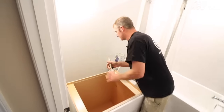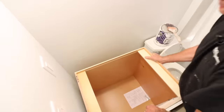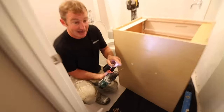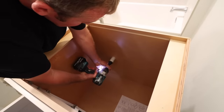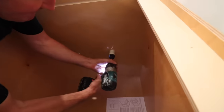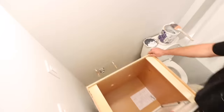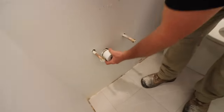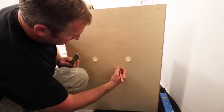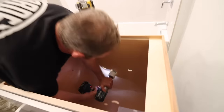This will take all the mystery out of vanity installation. Make sure your vanity is level, then dab the hot and cold water supplies with paint and push your vanity up against that paint — it'll mark the location of the supplies perfectly on the back. Pilot drill through that from the back, then use a core bit with a pilot bit to drill through the front; this will prevent any splintering and give you a nice professional look. Then dry fit the vanity, make sure it fits, and mark the pipe coming out of the wall for the p-trap and do the exact same thing. Pilot hole through the back, then use the pilot bit with a two-and-a-quarter-inch hole saw through the front so that you don't splinter the vanity.